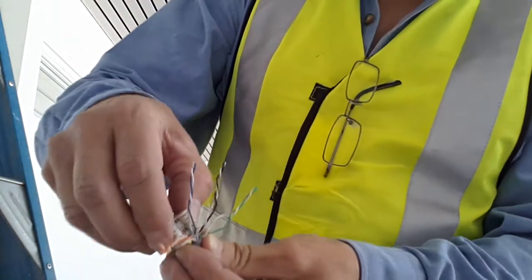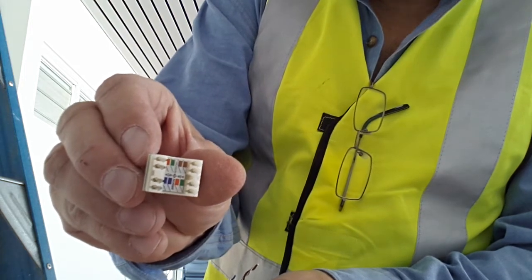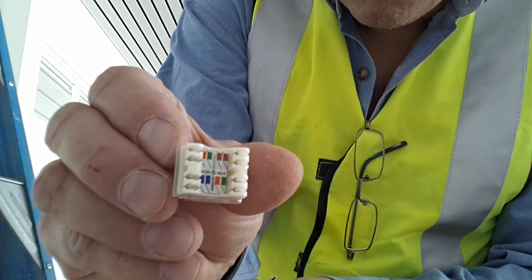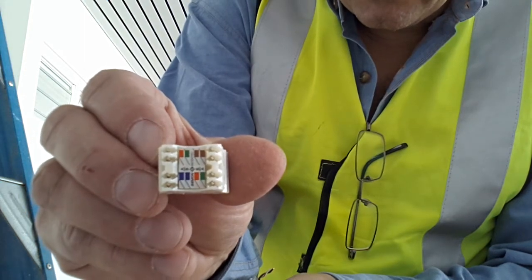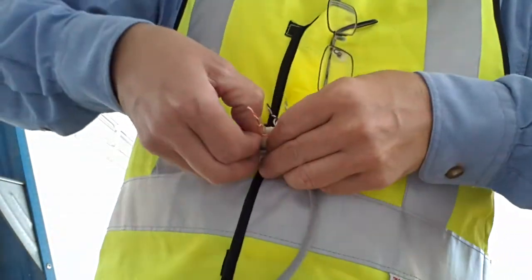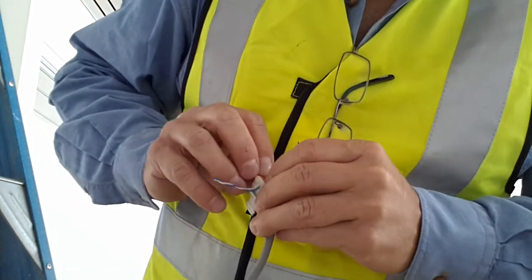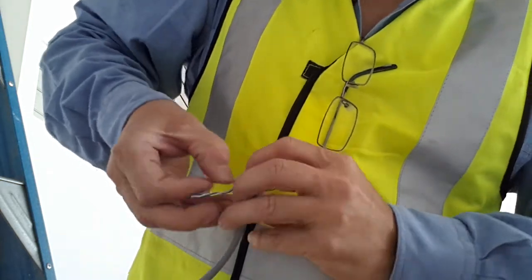So I'm just going to put these down. This one is 568A — we do the A wiring. Terminate on the top ones: white blue and crossing the pairs, white green and white orange. The cable is a bit stiff, so it's not that easy to demonstrate how to actually fit these in, but I'll try, maintaining the twists all the way to the termination point.